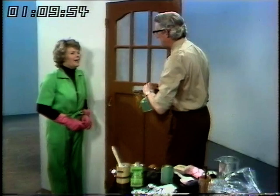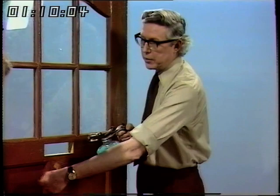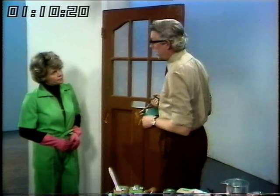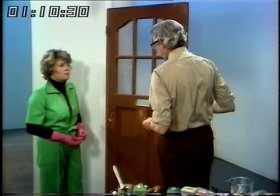You've got to be very careful with this and it is really better to leave it to the expert. It's also a good idea to have a bucket of water handy so that you can drop the burning paint into the bucket. Never, never put newspaper on the floor because your paint will drop off onto the paper and you'll end up burning the house down. It's a good tool and it's cheaper than using chemical strippers, but it does need an experienced hand to use it.